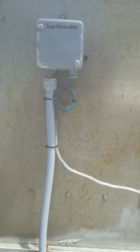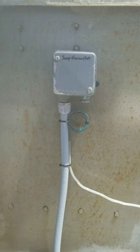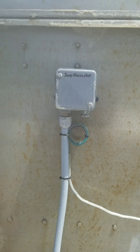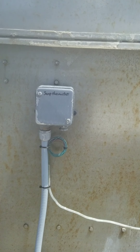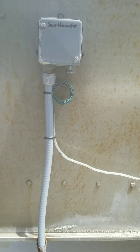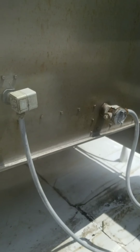When I did this pump I found the sump thermostat — the face had cracked and it was all corroded inside. This is fairly new; I put it in last year and you can already see the corrosion from the water. The new sump thermostat reads the sump temperature, and in the winter it will kick the heaters on to keep the sump at 50 degrees — I believe that's the set point.